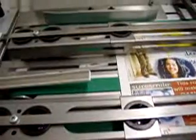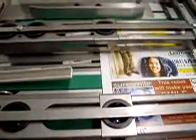What I do is I put the conveyor ball about 1/2 inch ahead of the edge of the booklet. The reason for that is to not only push the booklet against the stops, but to also hold the booklet down so your back register can do its job. Now notice the back register. You see how it comes up to push against the booklet? Now if you look closely, you'll see that the back register is off just a hair. See it?